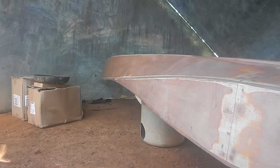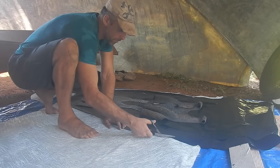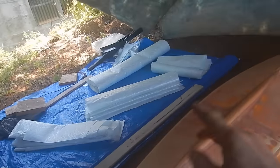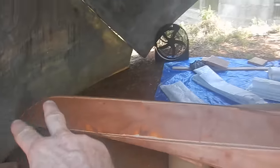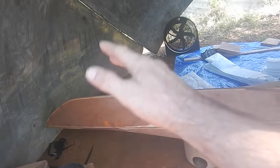Alright. Last coat of wax before I cut the fiberglass. Okay, I've got four different sections and three pieces in each section, so three total layers. I think the way I'm going to do this is put one here, then one there, here, here, and then there, here, here, here, then just keep going like that. Because if I do one layer all the way to the end, by the time I get back to here, this part may have dried, and it's better to put layers on wet layers, because they'll mix together better.